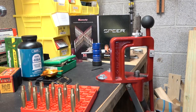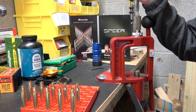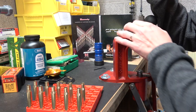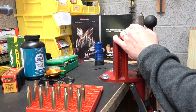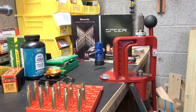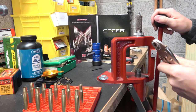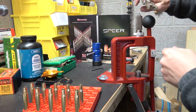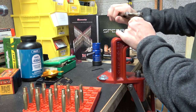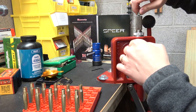We're going to go with published overall length on this. If we run into terrible accuracy or the bullet jamming into the lands, we'll play with the seating depth. I'm going to have to break this seating depth ring loose first — it's a little rusty. The adjustment is knurled but doesn't have a wrench flat, so I'm going to use vice grips. There it broke loose — probably put a little ding in there, but not going to worry about it too much.